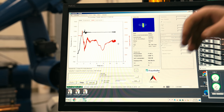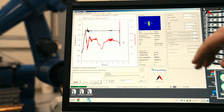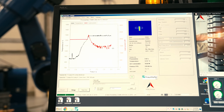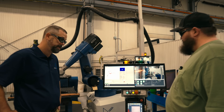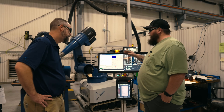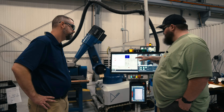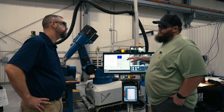It can read in a vast area, or as we're doing right now, to make sure we don't burn any edges away, it's reading just inside this little box right here. You can set up different parameters to monitor the system — absolutely. This gives us full control over how hot the laser will start. Right now we're running it at 2000 watts as soon as the laser turns on, and it'll range anywhere from zero watts all the way up to 3 kilowatts.